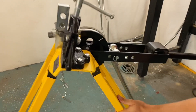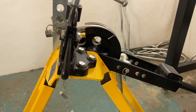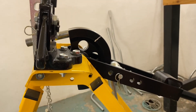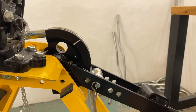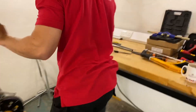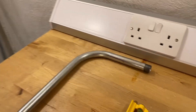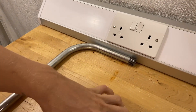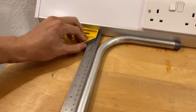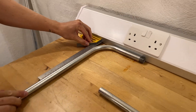So I'm going to pull it down until — there we go. You've lined that Tippex mark up and you think that might be somewhere very close to 90 degrees. Let's have a look then — move my expert piece of conduit out of the way. There it is. Set square against there — wow. Tippex came in handy there. Brilliant — so that's the first bend done.